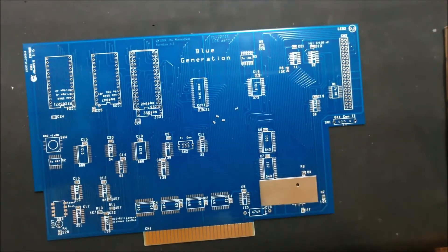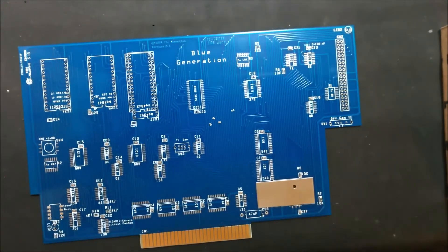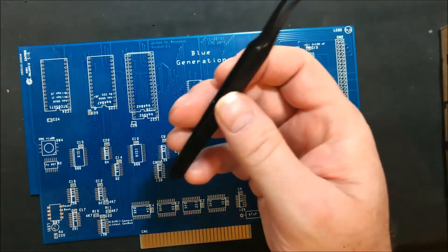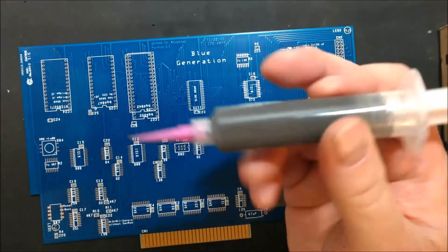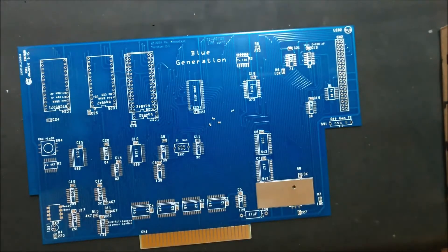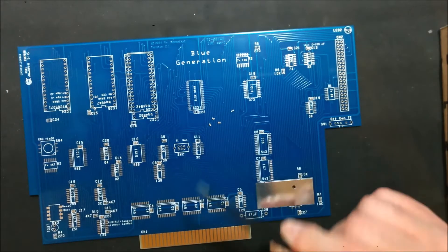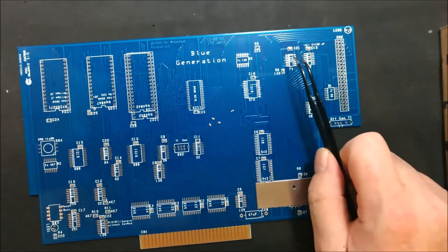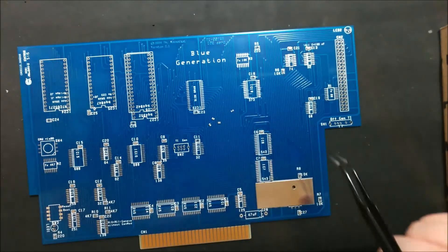And of course my good soldering station. I've had to jury-rig a box so y'all can actually see what I'm doing. Another good thing to have is a good set of tweezers. For the surface mount resistors and capacitors, I'm using solder paste. As you can see, I just cover enough of the pads. All the capacitors on here are 0.1UF or 100NF.